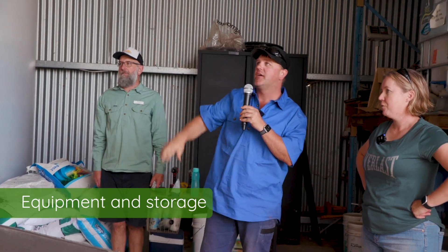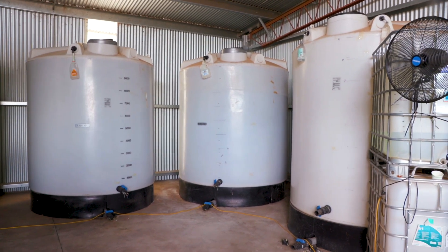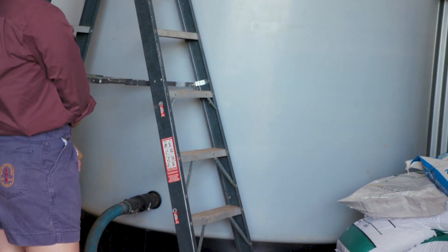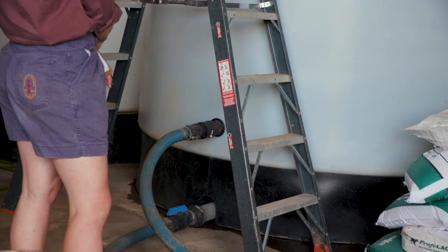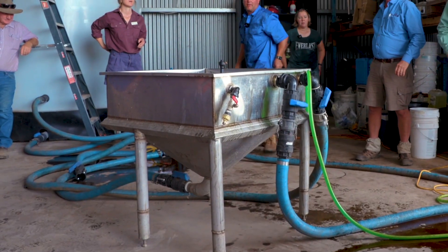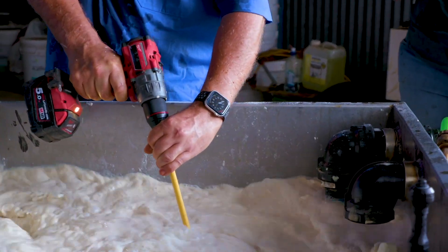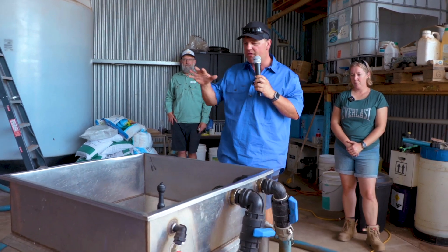These are our storage tanks — 16,000 litre tanks — and these are our brewing tanks, which are 9,000 litre tanks. These tanks have got two outlets: one at the bottom, as they're a cone-bottom tank. The outlet that's just up the wall a little bit has a 45-degree elbow inside the tank, so when I suck it out of the bottom and pump it back into that one, it swirls the tank and mixes it. The 9,000 litre tank is continuously mixing the entire time we're making, and that's our main mixing process. The tank we put all our ingredients into is just a very convenient size and height to put bags and drop liquid into and work around.